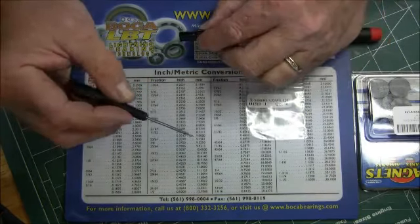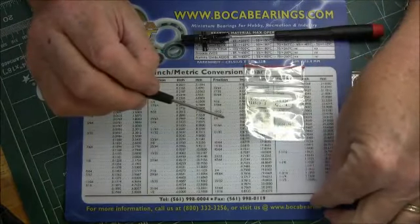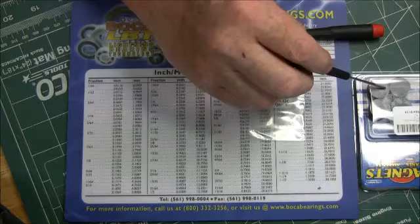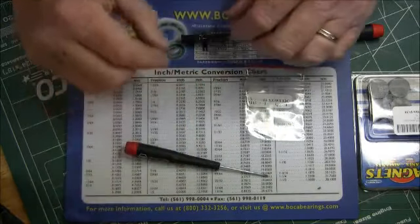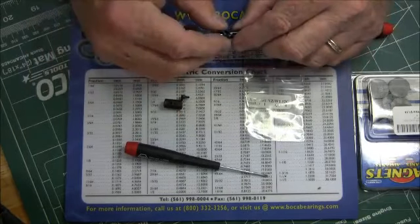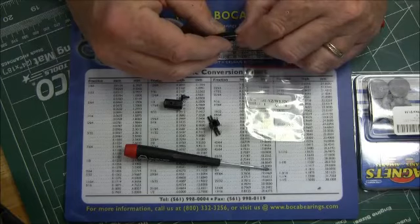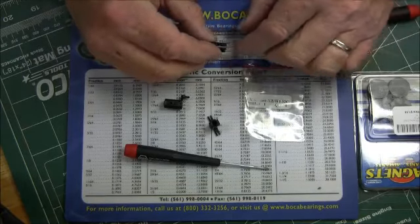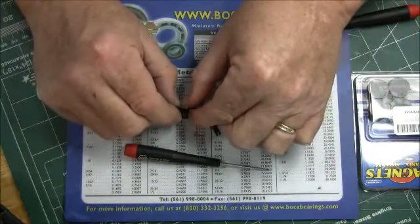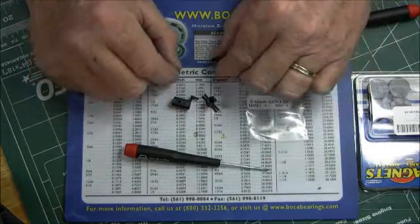And you'll notice, since I magnetized the ends of the screwdriver before we started with these little magnets that you see right here, it helps to maintain control of the fastener. Slide the blade grip off, slide the feathering spindle out of the hub, and drop the little washers that you see right here, and we're ready to start disassembling the bearings.